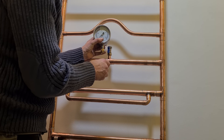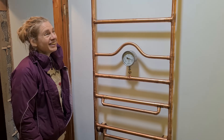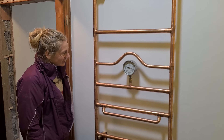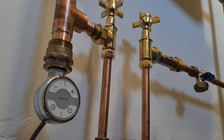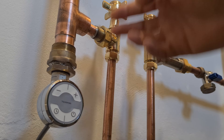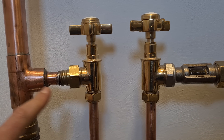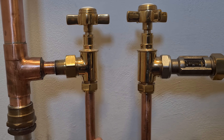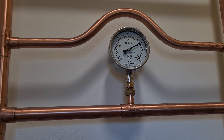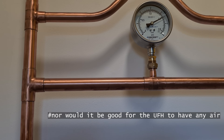Here's a bit I've been quite looking forward to — we're going to put this gauge on there. This cool gauge only goes up to 2 bar, so it wouldn't have liked the pressure test. One super important anti-explosion measure to mention is that when this electric immersion heater is on, the towel rail still needs to be open. With either or both of the valves open, the rail has access to the expansion vessel on the underfloor heating circuit here. That's what stops the pressure rising ridiculously and exploding when it heats up. If you didn't do that, you'd have to do some wackiness of leaving air in the top and having some kind of buffer, and I don't think that would work very well with a towel rail of this size anyway.